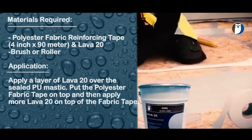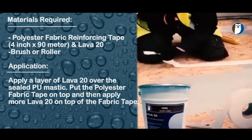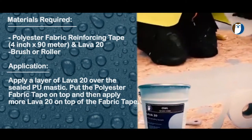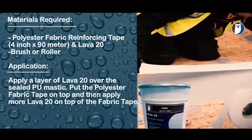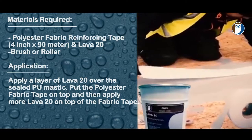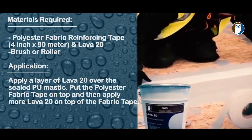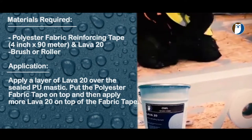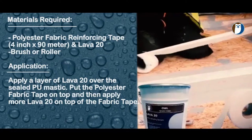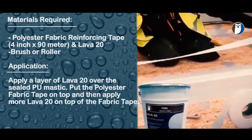As you can see here, the Lava 20 is being applied over the joint, which has PU mastic in it, followed by primer over the entire area. Now a bed of Lava 20 is being laid. The polyester fabric tape is now being cut to size before being placed over the joint. Straighten out any creases and install the tape directly over the joint, patting it into place.